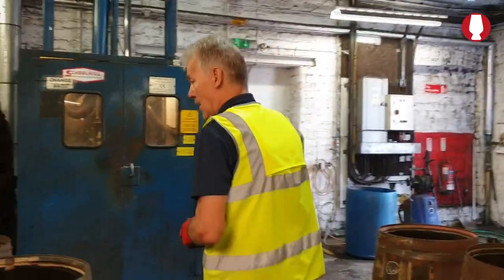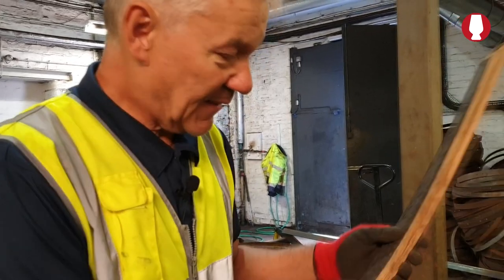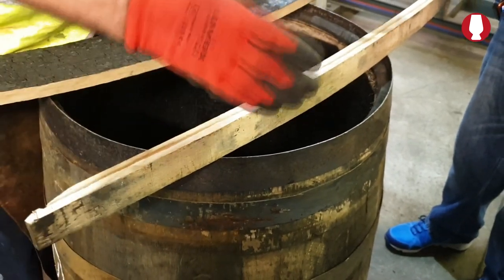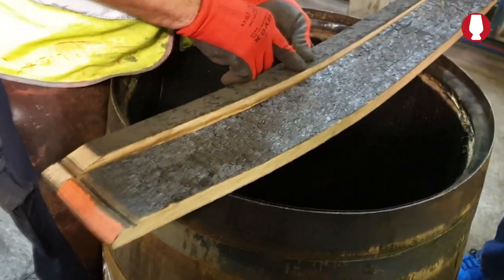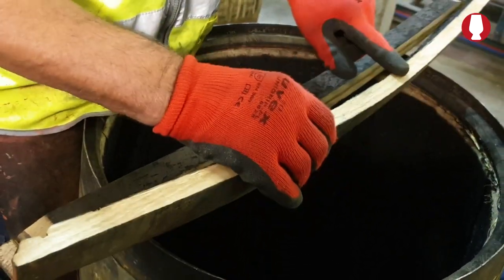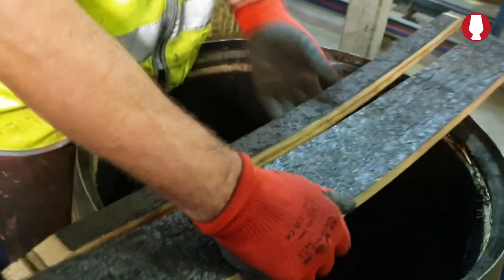Right. Two things that come off of that. This stave here, first fill bourbon stave. That's the way they come in from America. As I said, you can see the brown line again. That's perfect. When you rechar it, like this one, an older one, you'll notice the difference in the thickness. When you dechar it, it's going to get thinner. So you've got one more process. I'll go like that, then we'll go to a different one. But that was an old waterlogged stave, it's been recharred, and it's back brand new again.